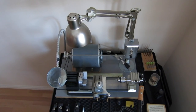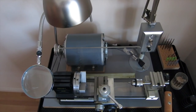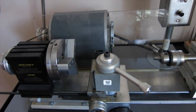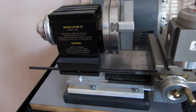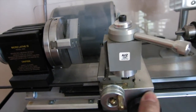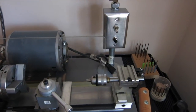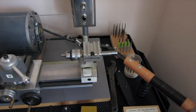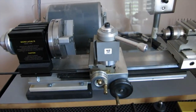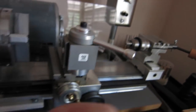Another unique and unusual tool that I own is called the TAG micro lathe. It's about the size of a jeweler's lathe and very well made — made in America, in Arizona I believe. They do make accessories for this so you can use it for wood and turn small items like pens, handles, and things like that. But I use it for metal, and just like a wood lathe you put your work between centers and use this to turn down the diameter of whatever you're milling — aluminum, steel, copper, brass — and you can make small parts like shafts or pins for models.